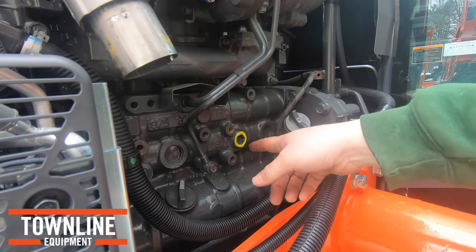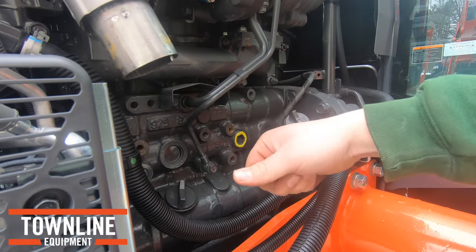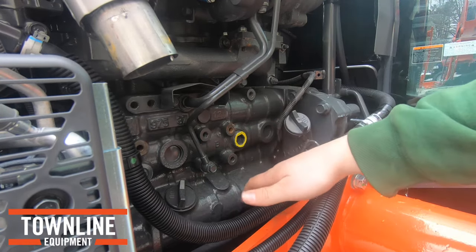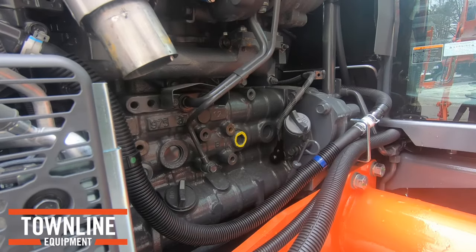So right here, highlighted in yellow, is the freeze plug that we're gonna take out, and that is where your block heater is gonna live, and then we'll probably zip tie the plug down to the lower line here so it's always easy and accessible on the outside.